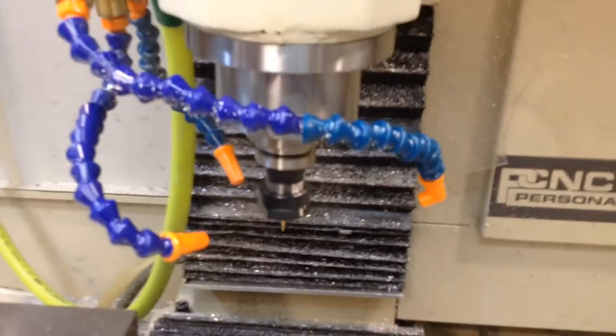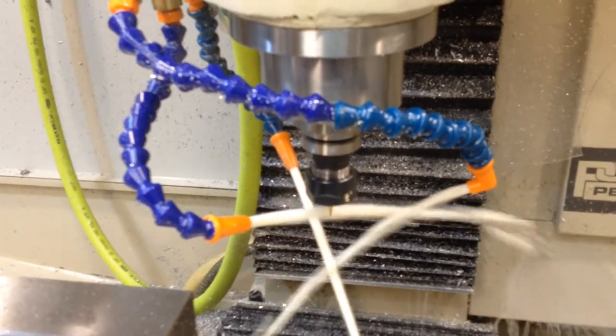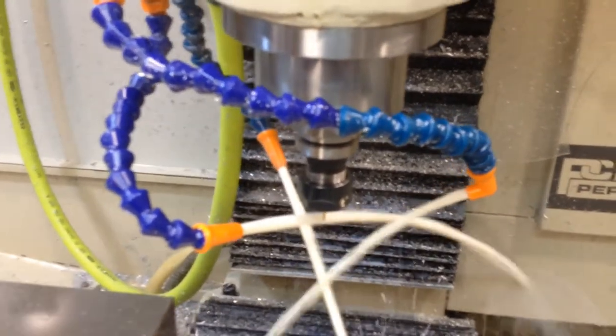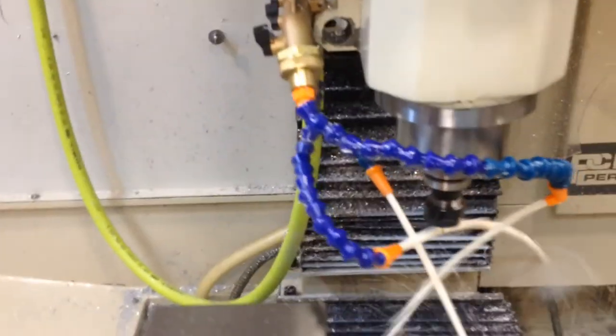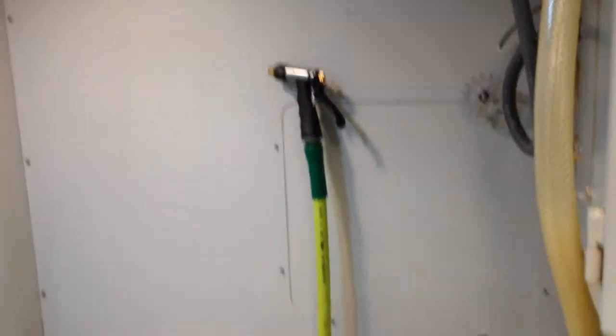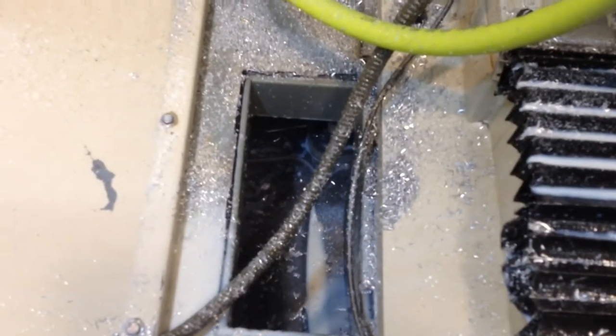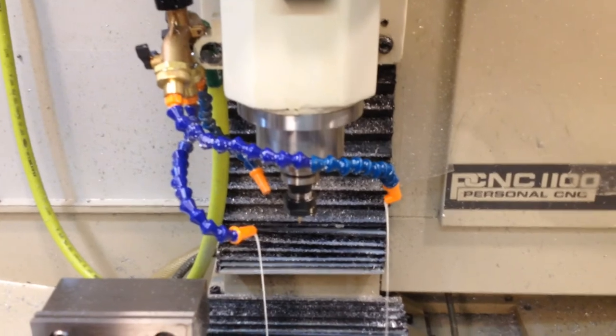Right now I have the nozzles barely open so I don't douse myself with coolant. Everything just drains down into the pan. What you can do at the end of the day is shut these valves, open the one to the hose, and spray everything down — it washes down into that first pan. Then the next morning, after all the coolant has drained out, you can pull that pan out and remove all the chips. Thanks for watching.